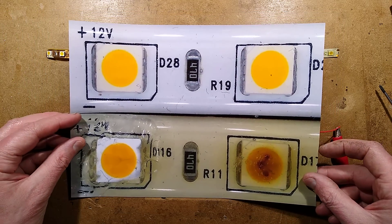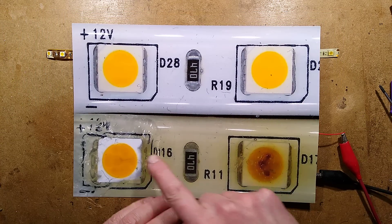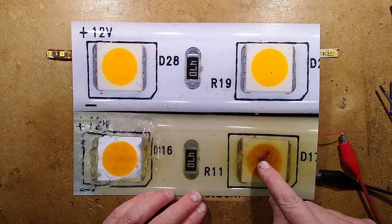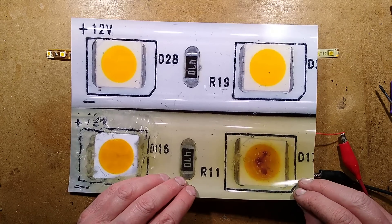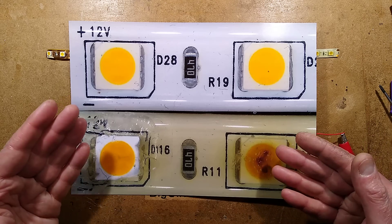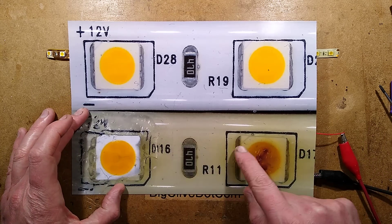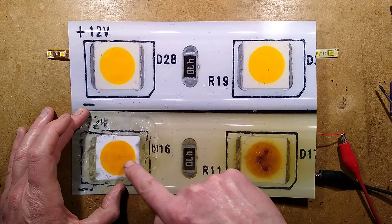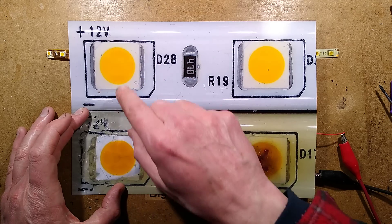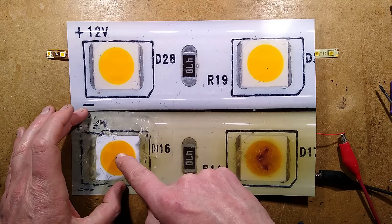When you looked at the LED tape — this is the new stuff — the older LEDs had developed a really strong dark dot on them, basically blocking the light. I initially thought the phosphors had degraded, but when I actually picked the surface gel off, the LED was absolutely fine underneath. Comparing the two, it looks just as bright as brand new — actually pretty good.